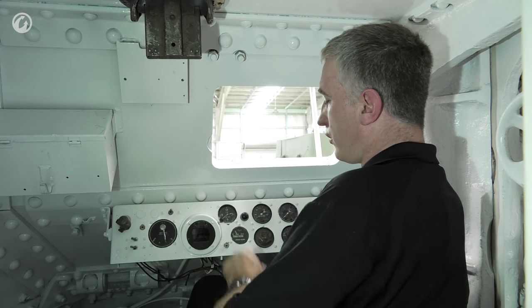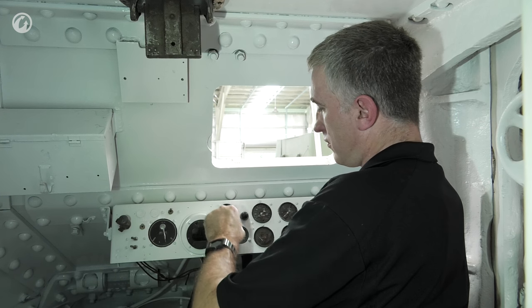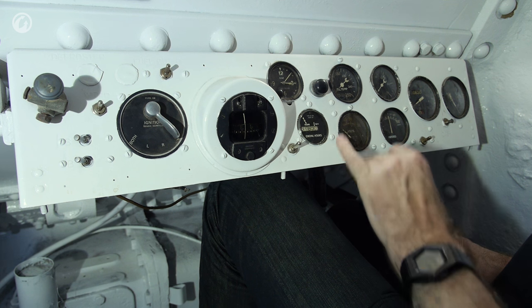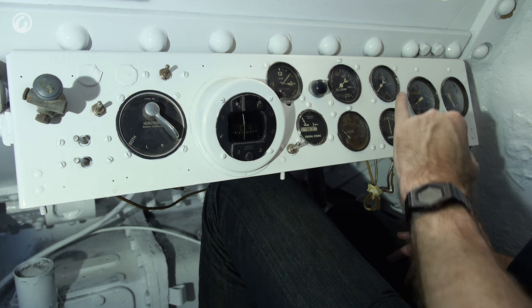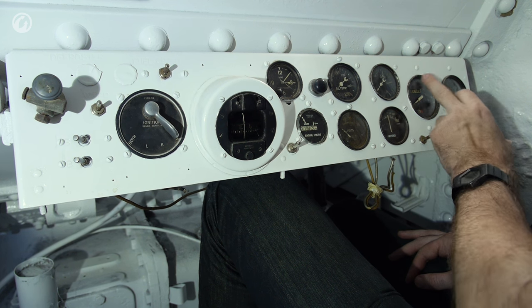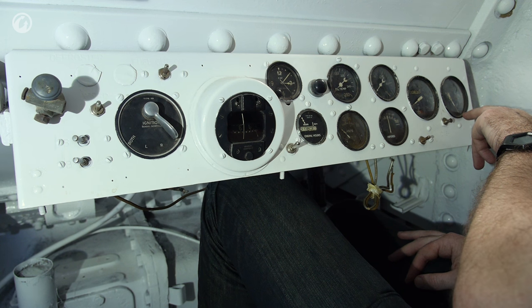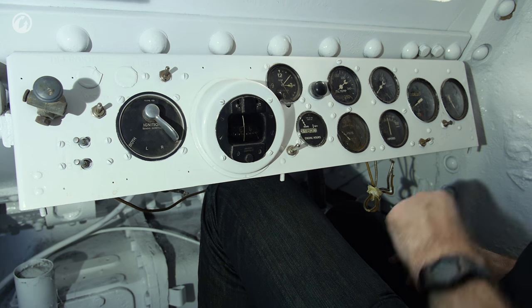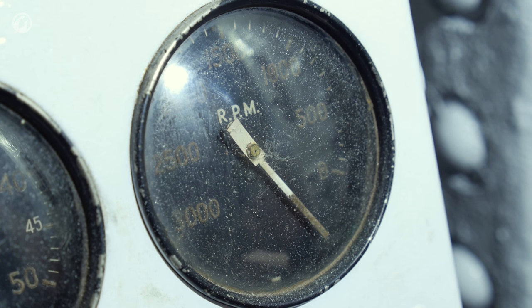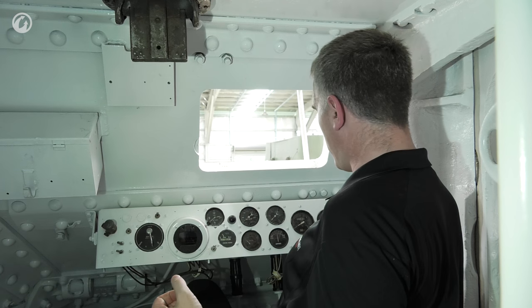There is a clock — a wind-up clock — if you want to know the time. The dash also has engine hours, oil temperature, oil pressure, voltmeter, ammeter, and a speedometer that optimistically goes up to 50 mph. The tachometer runs in reverse: idle is on the right and all the way anti-clockwise is 3,000 RPM, though it should be limited to 2,400.